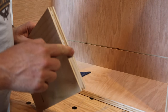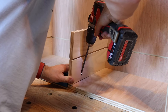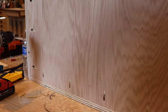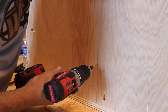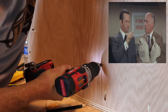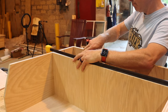Next up on the assembly was what will forever be known as the doodad shelf. There's no magic to it — just make sure your dados are properly aligned. Using a tape measure I found the center, then used my speed square as support and pocket screwed the shelf in place. I found the center of where the shelf was going to be, made sure it was plumb, flipped the cabinet around, transferred the measurement to the back so I could surface screw through with deck screws — and of course I missed it by that much. After correcting that mistake, it was back to the pattern: glue, pocket screw, assemble, repeat until assembly was complete.